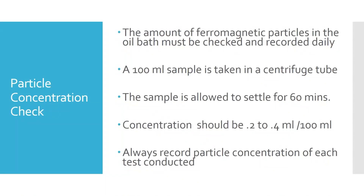The rate of evaporation is so slow that it's rare you'd have too many particles unless you over-add them when mixing the powder in, which can certainly happen. In that case, you have to either add more fluid or drain off some of the fluid and particles, then add fluid to dilute it. Another method I've heard of is taking a permanent magnet and running it through the tank to draw out particles and bring the concentration down, though you'll then have to test and adjust it again.